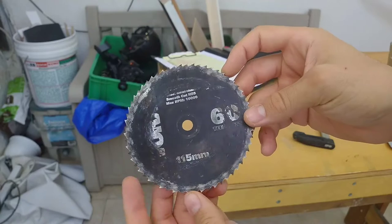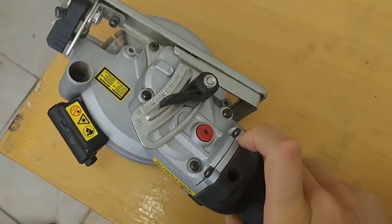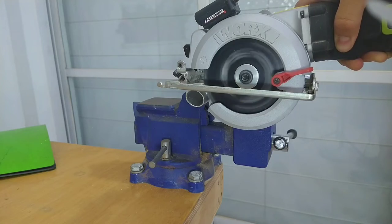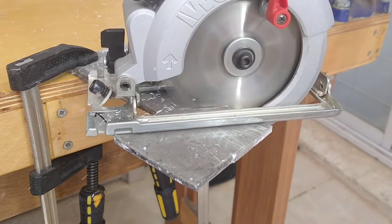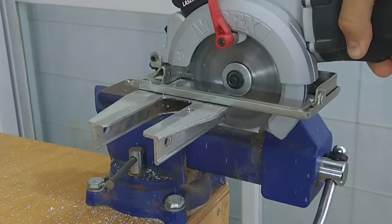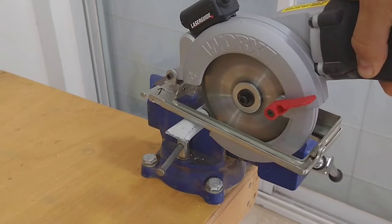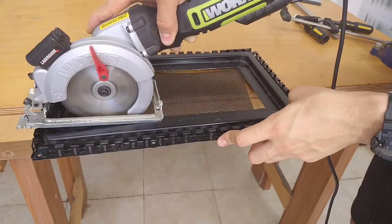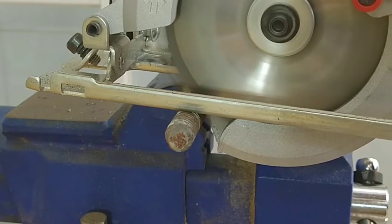What I'm most interested in is the blade for cutting thin steel. The instructions say not to use abrasive wheels, so we'll test that as well. Here I'm using a cheap blade I bought on eBay — they're all horrible at cutting wood, being twice as thick as they need to be with teeth that chip and break off constantly, so I use them mostly on metal. Here I'm cutting a relatively thin steel tube and making plunge cuts into steel mesh, but this is where the effortless cuts end. Although this bolt basically destroyed the blade, I was surprised to see how quickly I was able to cut through it.